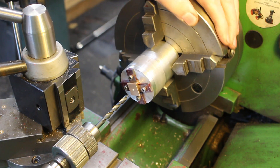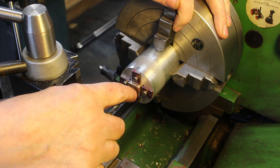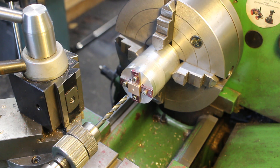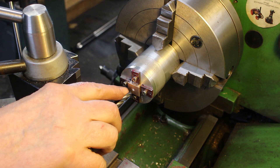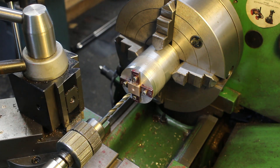We've got a pin in here and at each end of the pin there'll be a slight cavity, so we'll see how it goes — just need to be careful and take it easy. Starting off with a 6.2mm drill. This is bronze, so the cutting edges of the drill have been flattened off with a stone just to give them a negative or zero rake — that'll prevent the material pulling the drill in.